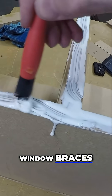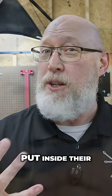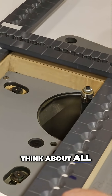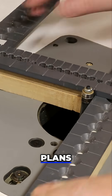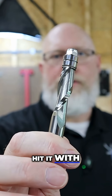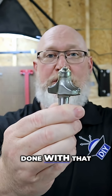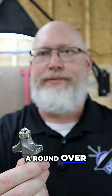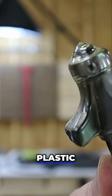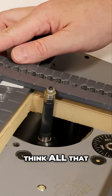Take, for example, the pretty window braces with the rounded-over edges that no one's ever going to see that everyone thinks they should put inside their subwoofer boxes. Think about all the steps involved: draw out your plans, mark out your cuts, rough cut with a jigsaw, tape down some templates, hit it with your flush trim bit, and repeat these steps for every hole you need to cut. When you're done, swap out the bit and hit it with a roundover. This roundover bit's still in its plastic — I bought this after I bought the CNC machine and have never used it.